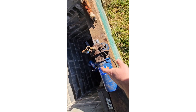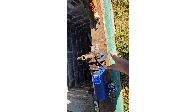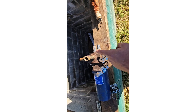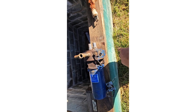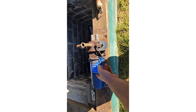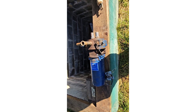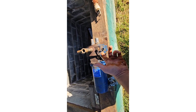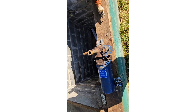Let me backtrack — you've got three types of pumps. You have a deep single-pipe system which usually goes around 300 feet into the ground to suck up water. A shallow well system uses an above-ground pump that pumps maybe 60 feet into the well. And then you have a deep well above-ground pump like this, which is a two-pipe system — one pipe pulls water up and one feeds water back into the well so it doesn't dry out.